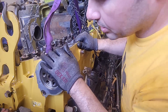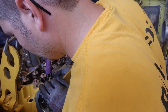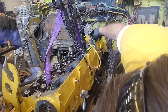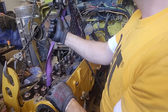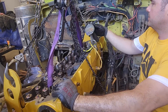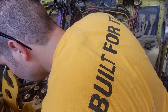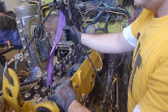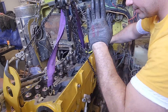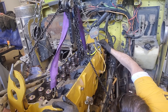We are down to the nitty-gritty — we're going to start lowering it down. One thing I don't like too much is the chain mechanism — not that it's not smooth, it's just the chain is really long. It's a 10-foot fall for the chain mechanism, and since the height of the crane is only 9.5 feet, it's just kind of long. I wish it was only maybe 5 feet, but I guess I could shorten it if I wanted to. I'm not sure if they make a lifting link for C-15 heads that works well. This setup does work, and it's kind of universal for any head. But if you know of a manufacturer that makes a C-15 lifting link — not the factory ones on the end, something just for lifting the head on and then taking back off — let me know. It would be nice to have something more dedicated rather than this universal setup with different links and chains.